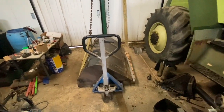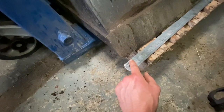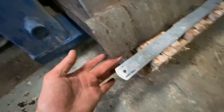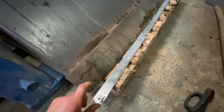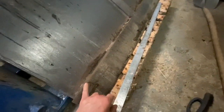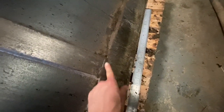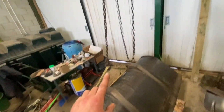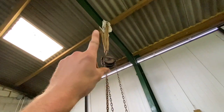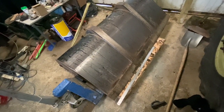So the next project is the tractor bucket. We noticed a while back that these corners are being worn out, and you can see how much has been worn off — a good 50mm. It's actually into the corner of the bucket itself, basically lost two inches off it altogether. So I ordered a new cutting edge. What I've got to do now is go down and nip through all these welds all the way down, through the main bit, then on the other side flip it back over and cut through them. I've just got it on the chain hoist onto the roof beam, with a bit of rag up there just to protect the strop, and flip it right over. Use the trolley to get in and out and mess around.